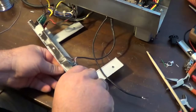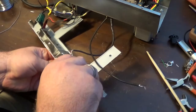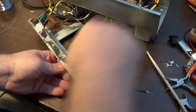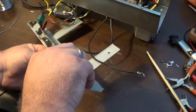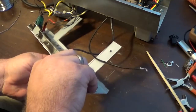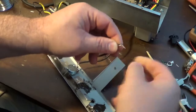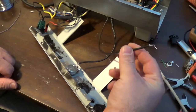Because now, if I turn it up, that oscillation is no longer present. And also right now I've tied the two ends off on this, so that is completely gone. So basically the lead going back in there is grounded. And now I can turn this up and turn it down all the way, both ends, with no oscillation, no feedback, no hum, a little bit of hiss, which is always inherent in that. But you can also see when I mess with the end like that, it's giving us some signal pops in there. But with it grounded, you can't hear anything.